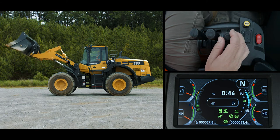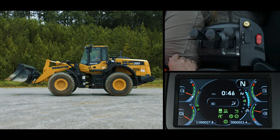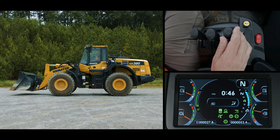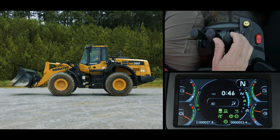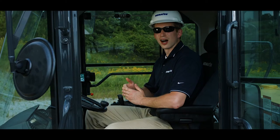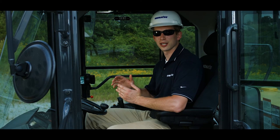Now firmly push the boom lever all the way forward into the float detent. Gravity will cause the boom to lower very rapidly, and it will stop short of hitting the ground. Do not try this movement with any material in the bucket. You can clear the lower remote positioner by placing the boom below horizontal. Push and hold the top remote switch until one long beep is sounded and the line disappears from under the bucket icon.